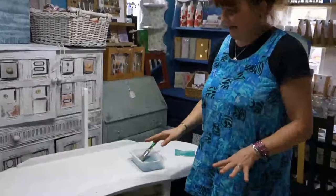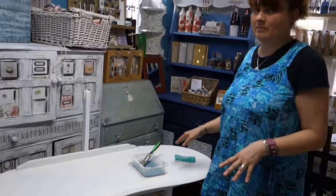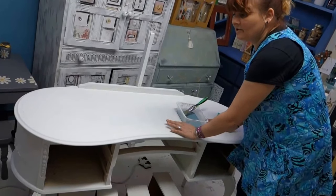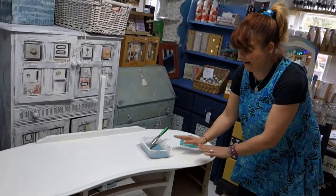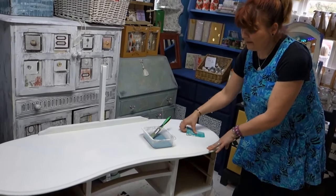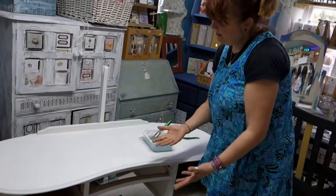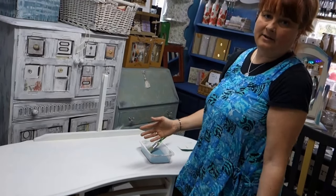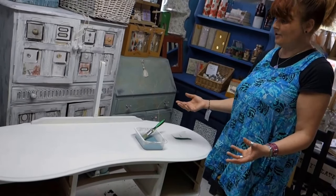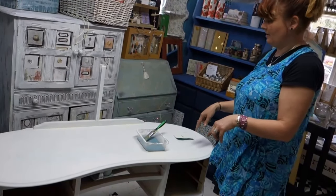New day. Yesterday we had a few disasters and learning lessons, which is all good when you use a new product. It isn't chalk paint, it's milk paint, and what I've learned is that putting it on melamine shiny surfaces you definitely need to sand it down first. Having done that and put the white on top, it's stuck really, really hard. Coming back today and gently rubbing down with sandpaper — it's much harder to rub off than chalk paint. So key your piece of furniture with sandpaper, use the bonding agent and perhaps a little extra than recommended when the surface is shiny, and I think you'll be fine.